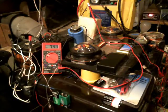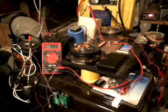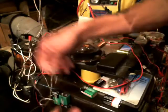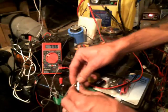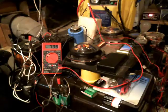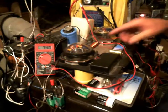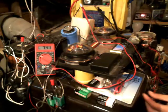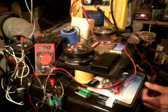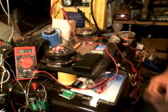That battery's not fully charged, and the battery on the opposite side is probably even less. I tried to drain them down to complete zero and let them charge back up. So these batteries aren't fully charged. I'm going to hook this back — you'll notice a little drop in the voltage when it all gets started. All this other stuff over here is just the load I normally had it attached to. I'm going to connect the negative side and you'll watch the voltage change — it'll start going down as it runs the load.